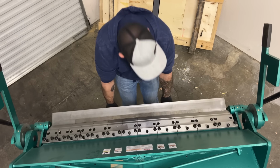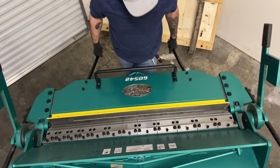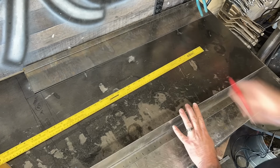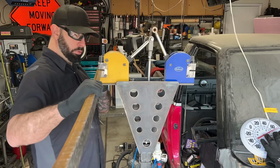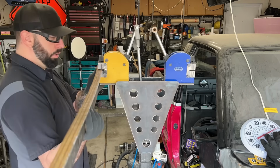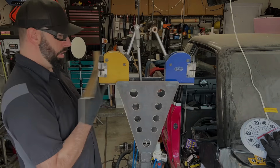This longer piece will be for the inner extension of the wheel tubs. I'm breaking it to create a lip that the bed walls will spot weld to. On that lip, I'll mark every inch, which will help me stretch it evenly. Stretching this lip will gradually cause the piece to bend, and I will continue stretching it until the arch matches the curve of the fender that I bought. Well, that was the plan anyways, but my stretcher isn't playing nice with this 16 gauge steel.